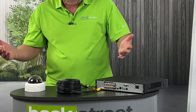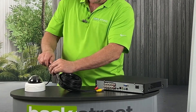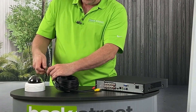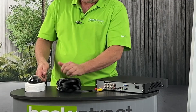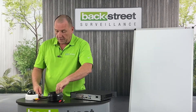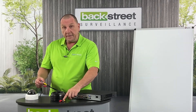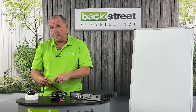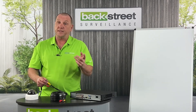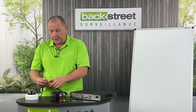The system basically consists of connecting the camera to the video fitting on the cable and connecting the power. That's also an important safety tip: there is an NVR end and a camera end on the cable. Don't plug them in backwards — we've had some customers do that. It is marked on the cable, but you've got to pay attention to it.